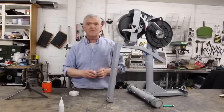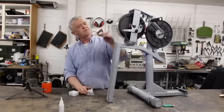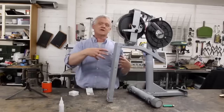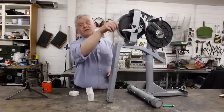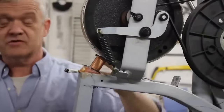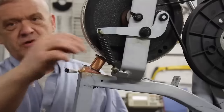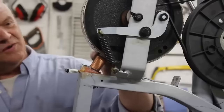I've got a whole bunch of neodymium magnets - I could put ceramics on there, but these neodymium magnets will just fasten on and be glued with super glue, which is fine because this is steel and the super glue just assists the attraction of the magnets. I glued these magnets on north, south, north, south, then stuck a coil from a microwave oven fan - lots of little turns - glued on with fiberglass resin. I stuck a piece of cardboard between them, squeezed the resin in, let it set, and we have ourselves a generator.